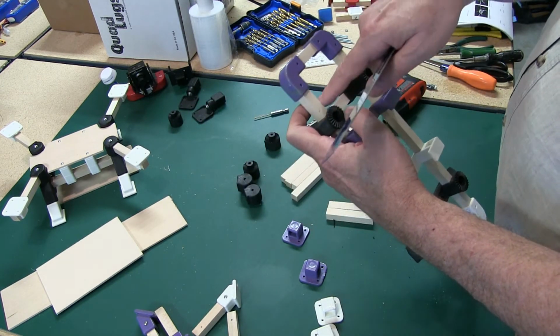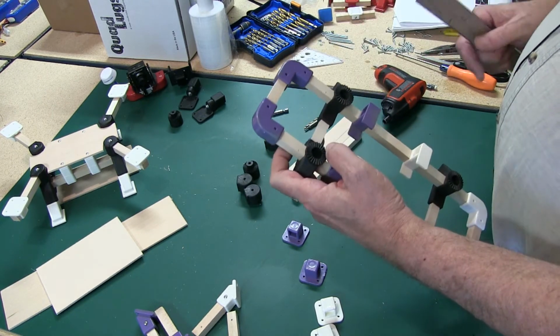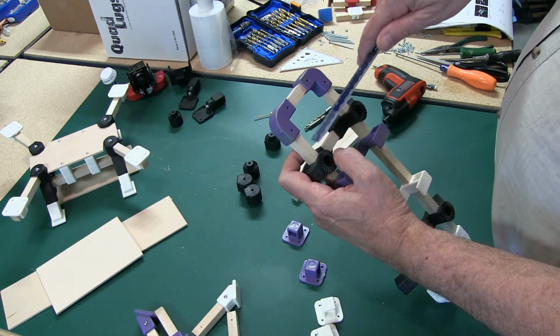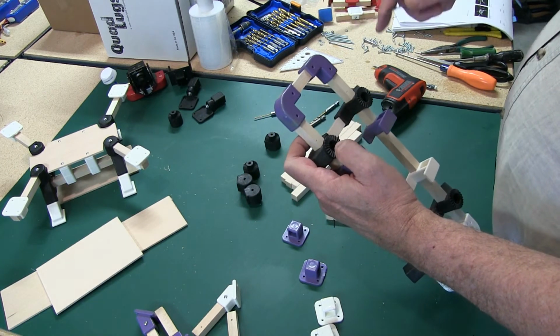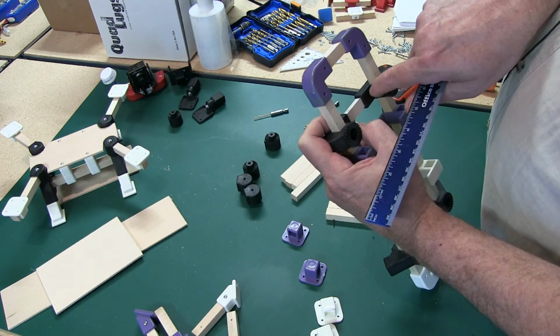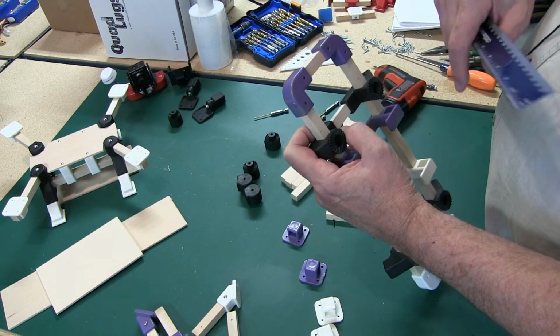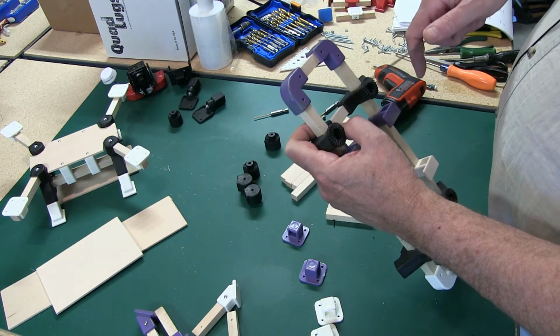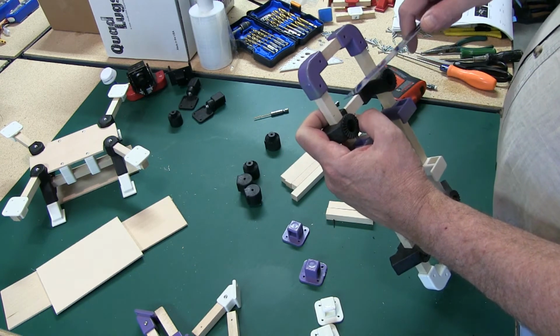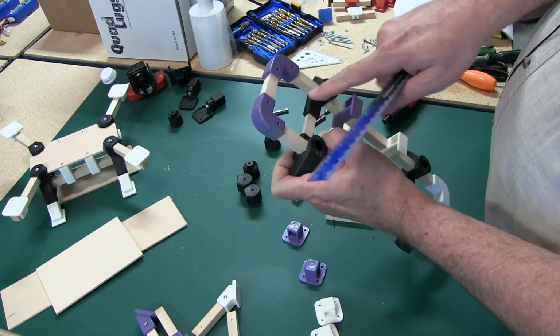And that'll give you this dimension here if you go to check it again, or if you're shooting for a certain size dimension. In other words, if you have 4-inch wood you want to put in here, you're going to have 3 millimeters and 3 millimeters here, so it's going to be shy of 6 millimeters because of that. But you could adjust this if you wanted to, and increase it by 6 millimeters for this width and this width right here.